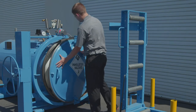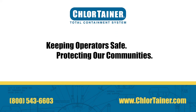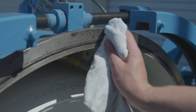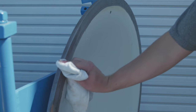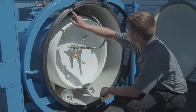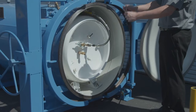We are now ready to close the vessel door. The first step before closing the door is to inspect it and wipe it clean of any dust or debris on both sealing faces. Inspect and clean the O-ring, making sure that the O-ring does not have any cuts, tears, or gouges. Replace it if necessary, making sure to use only a Viton O-ring.